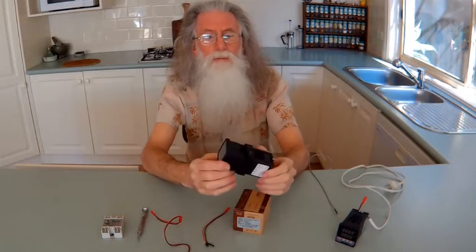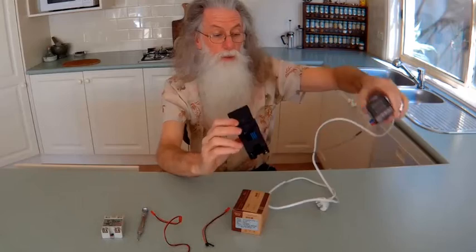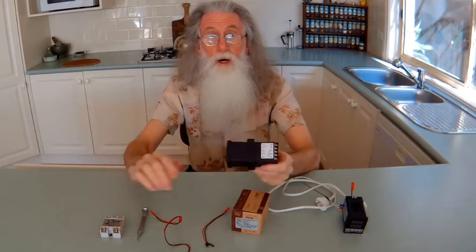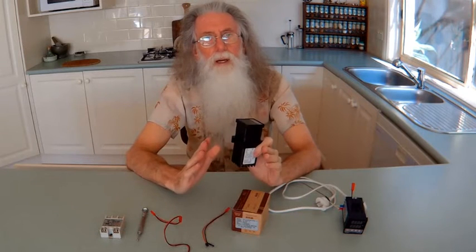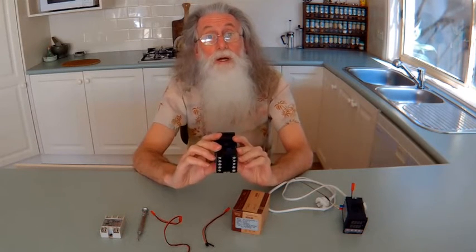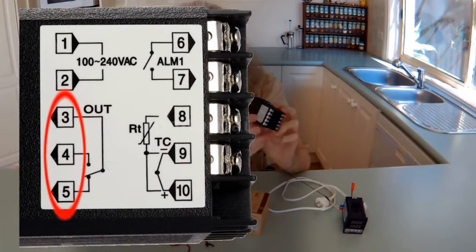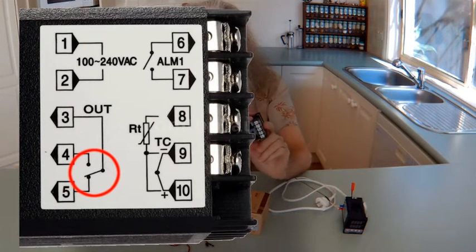Some are more equal than others — these are some of the original ones I bought. They look pretty much the same, but as time goes on they make them shorter. You can buy with an SSR type or a relay type output. This video is mainly going to be for the next step for the 3D printer, showing how to change over to thermocouples and SSRs. On the CNC4A, rows 3, 4, and 5 at the back have the relay — normally open, normally closed, common. But I did pay more and get an SSR one previously.